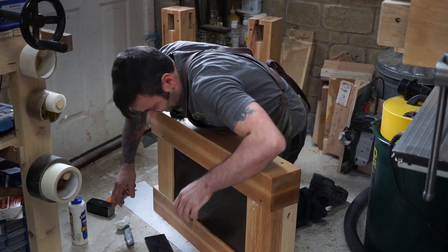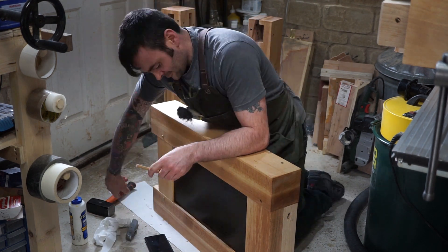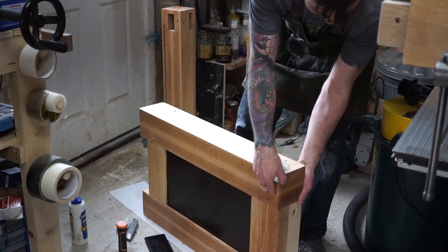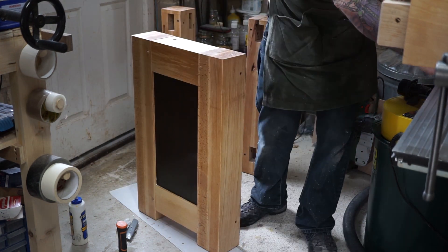As you can see, with gluing the joints they now have to be either pushed or hammered together, and when the pins are hammered in there's a little more squeeze out that occurs, so I know that everything is working as it should. I assemble the two ends, then the back, front and one end together, and finally place the other end on top and hammer it home.